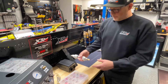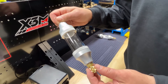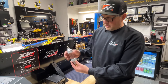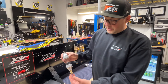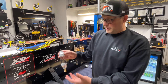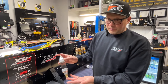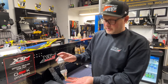Another part you can purchase from us is this air separator, which is a beautiful tool. Not too many pump makers or companies use this. It goes between the shock and the line, so when you turn the pump on you can see everything going on inside the shock — how much air it's pulling out. You can adjust the vacuum, and since this is the air separator, all the air bubbles stay at the top. So for sure, when you're bleeding the shock and refilling, there's no air bubble staying in the shock because all the bubbles are pushed out to the top of the separator. With this tool, you know for sure there's definitely no air — it's 100% clear. It's a beautiful tool, definitely worth having.